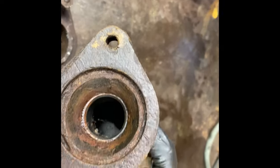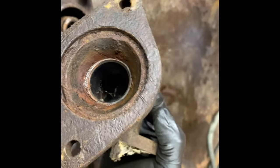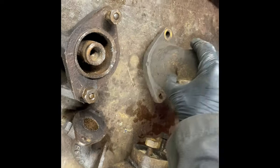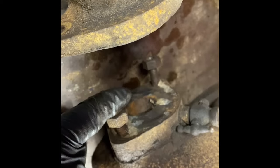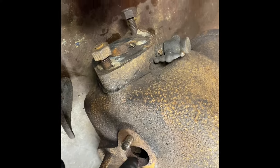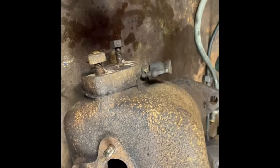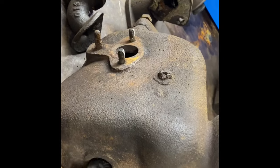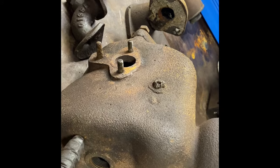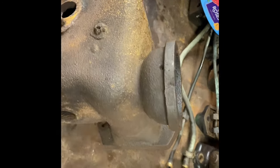It sprays up through there into the bottom of here, into this cone the other way basically, which is all machined nice and smooth, through that 90, then into here. And this is a machined tube that runs all the way through the vaporizer, through the middle of there, so you can blow a lamp through to warm it up. It's the first time I've got this bung out the end of here, and I can see it's a machined tube. Then that comes through there, up, and through into the inlet.